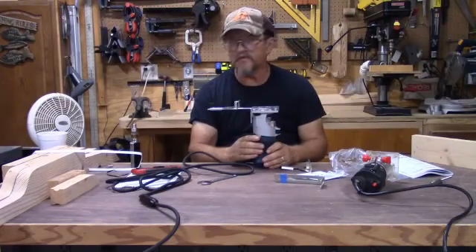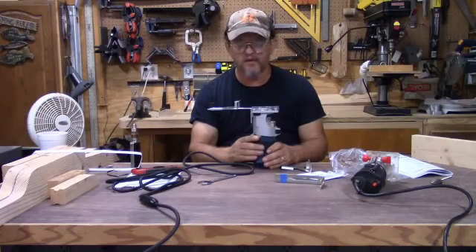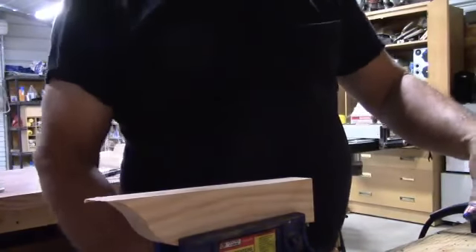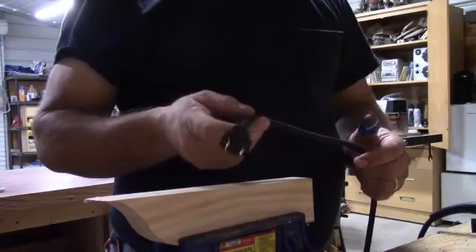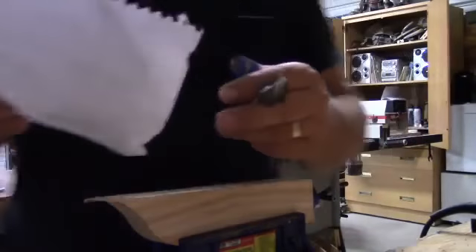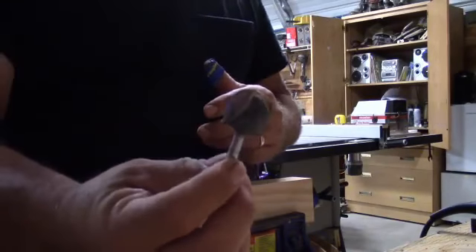What we're going to do now is turn the cameras off and move them around behind me. I've got a piece of wood in a vise and we're going to demo it and see how well it does. I've got my block of wood clamped in the vise. I unplugged the router — before you put the bit in, always make sure you think about safety first. I've got it unplugged. I'm using a double flute round nose router bit, which is what I'm going to use to make these grooves in the front of my nightstands.